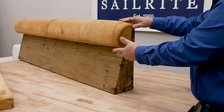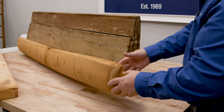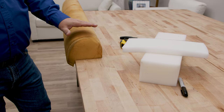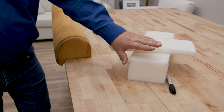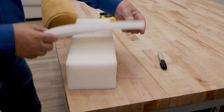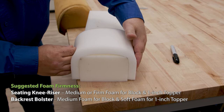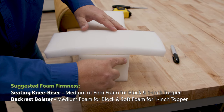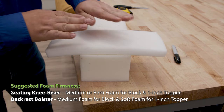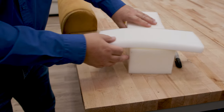This piece was glued on here, and that's for good reason. We need to take measurements of it. To make our rounded bolster we're going to use a square piece of foam, and we're going to wrap one inch of foam around it to give it a curved look. Before we wrap it, we're going to cut out some of the foam at the corners. To do this, we need to take measurements to calculate for the one inch foam we're going to add.